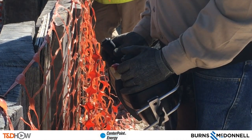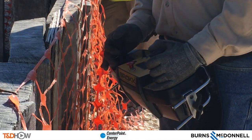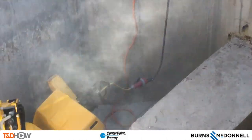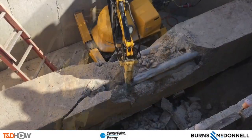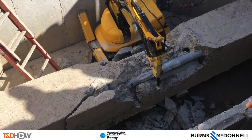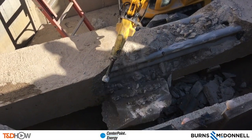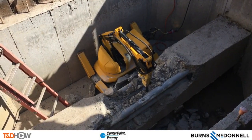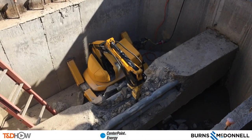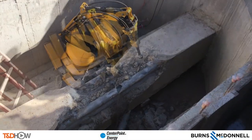Take another look at our operator and that control box with the joysticks. You see he's pressing down with his left hand — that starts the jackhammer — and maneuvering it with his right hand. We'll go down again and see that chipping away at the concrete. See that conduit now clearly exposed as we start to move larger chunks of concrete out of the way. You can see he can even fit the elephant's foot in between parallel runs of conduit, and in some cases part of the conduit may break away.